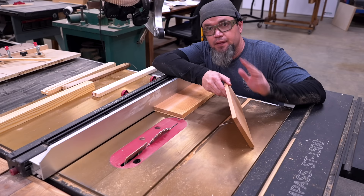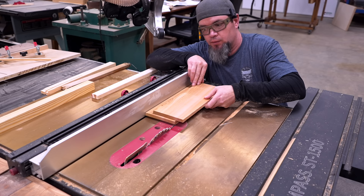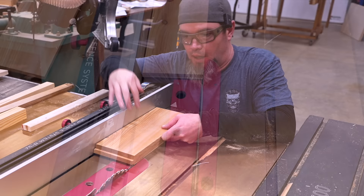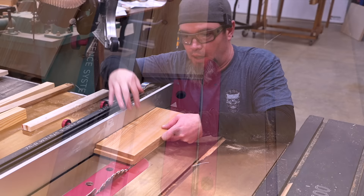For these sidewall parts we'll need eight pieces that are 14 inches long. Now that we have our sidewalls cut to length, there's only one thing left. Two parts need the 10-degree angle put on both sides. Since we have it on one side already, we want to put the long part of that angle down — the long part touching the fence with a gap at the top — then move our fence in one sixteenth of an inch and make that cut.